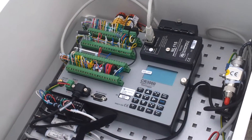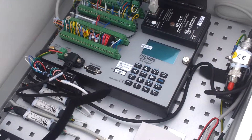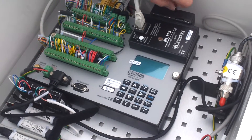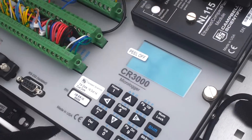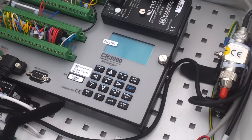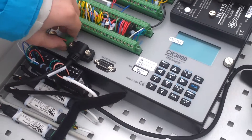Changing the card and powering down the CR3000. First, undo the screw on the card reader. Press the white button until the light goes green. Eject the card. And then remove the power.